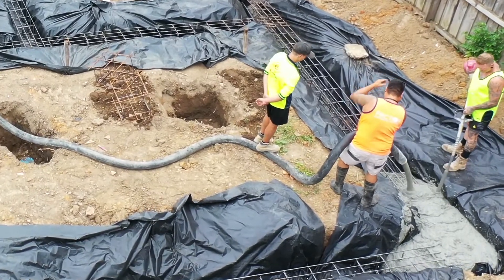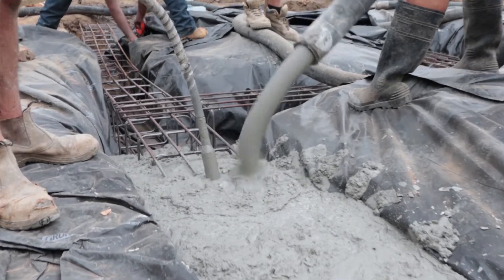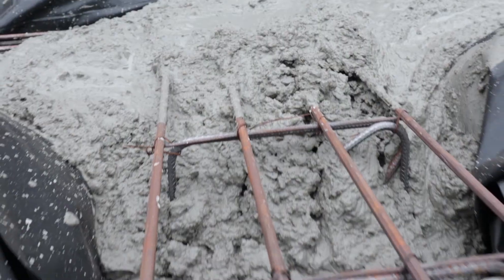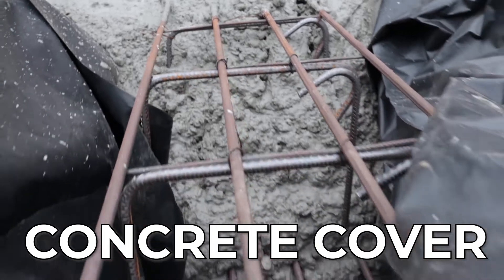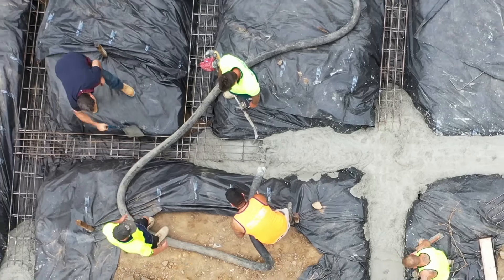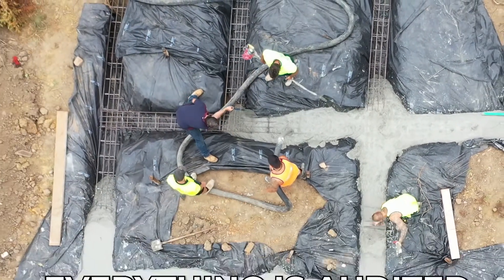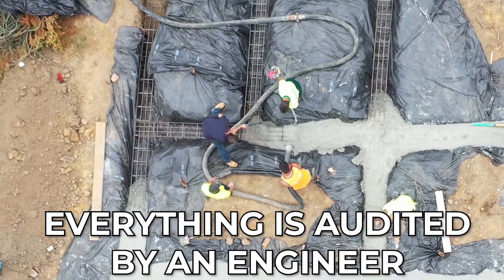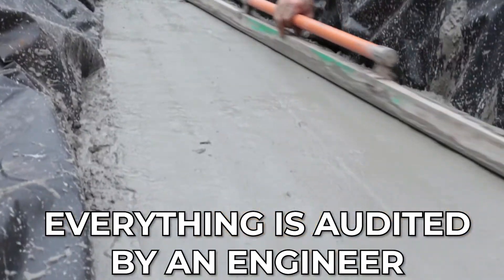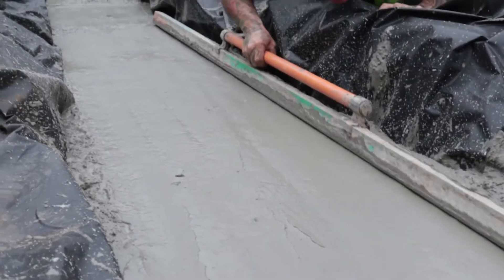The pH was about 4.1 to 4.2, and the things we've got to look out for here are the concrete cover — making sure the right amount gets applied while the contractors are working — and also that all the steel in the trenches is connected correctly. That all gets audited by an engineer, but we're also here on-site making sure all these little details are completely carried out.